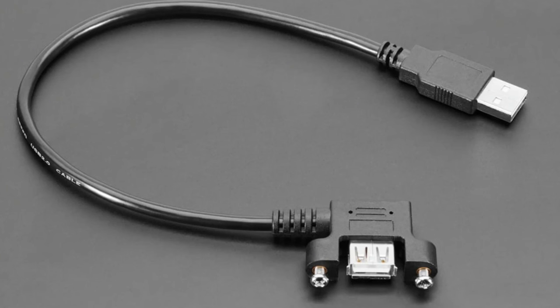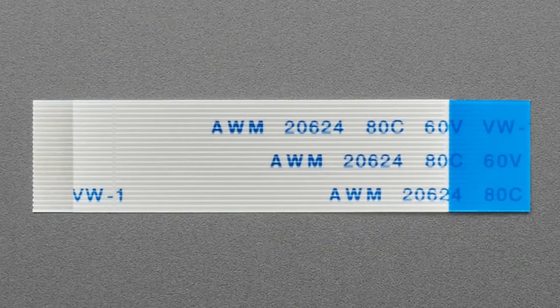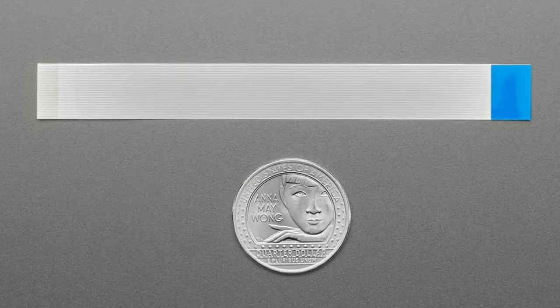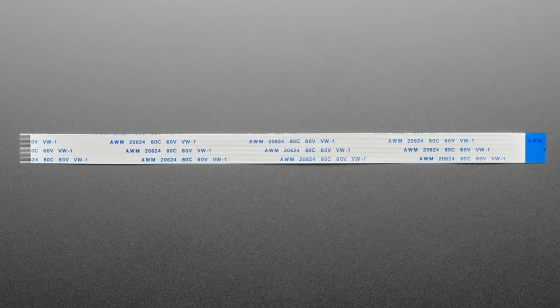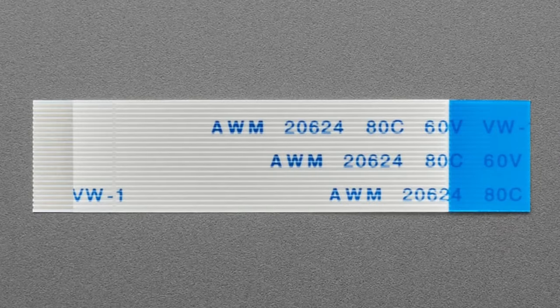It's about 30 centimeters long. We also have a straight-through version. Next up, we have three different lengths of 22-pin 0.5mm pitch AB flex cables. You can use them with the Raspberry Pi 5, and we're also going to be using and selling these for use with the Raspberry Pi RP2350 boards that have an HSTX connector.